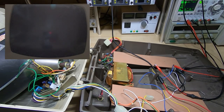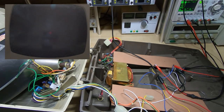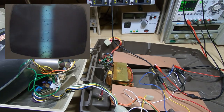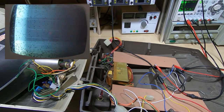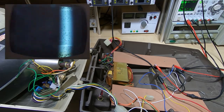I can see the heater starting to glow — you can just see through the neck of the tube there. I'll turn the signal generators on and then wait for the tube to warm up. As we can see, we're getting something on the tube now. I'll just increase the drive voltage on the video slightly and change the waveform to give us something a bit more useful.